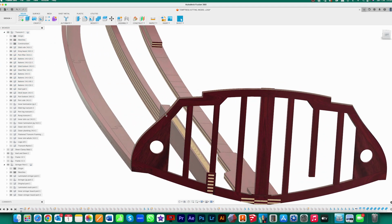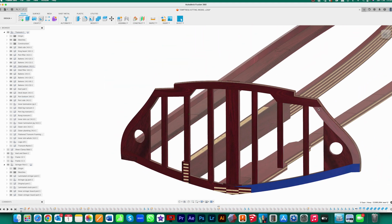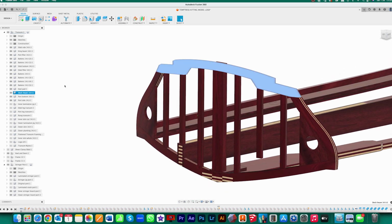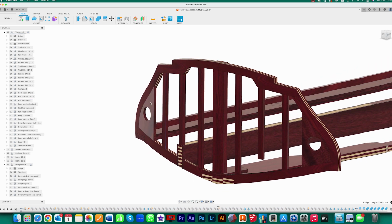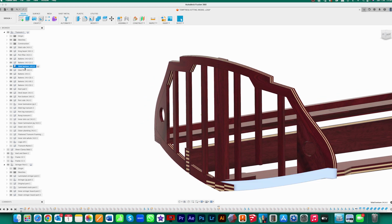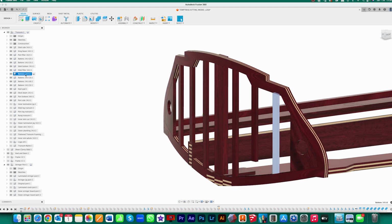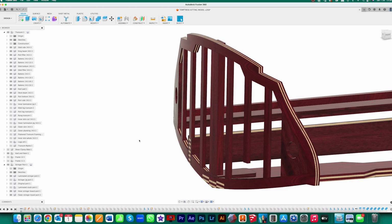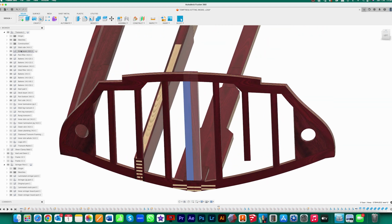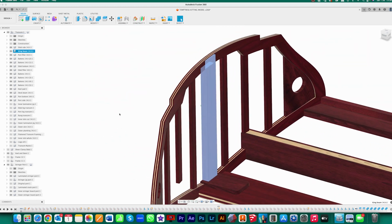If you remember, in the previous video we did this outer framing. We made that in the lamination jig, and we've got the correct curvature set into place on that. But what we've got now are these components in the centre of the transom. They form various different reinforcements that are going to help us to position the planking when it comes to putting the planking on the transom, and also just generally add some strength where needed. So we've got this king beam that is going to overlap and run up into the deck beam of the transom frame in there.